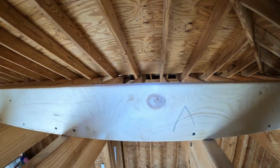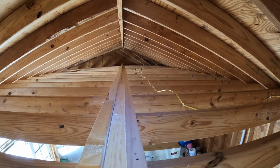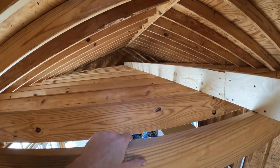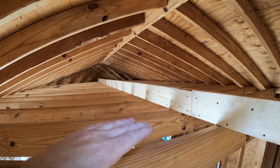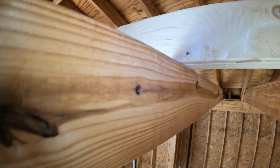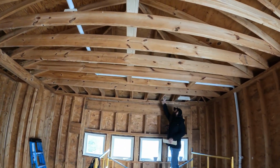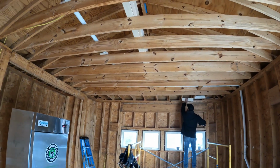All right, that's it. That's a stiff back or a strong back. You might hear some other term as well, but that just gets your joist fairly straight. They should have done this when they framed it actually, and we wouldn't have had so much sagging in here, because it's almost 16 feet wide. So we are going to take 2x4s and sister right beside the ceiling joist and set it right to the laser. That way we will have a flat ceiling.